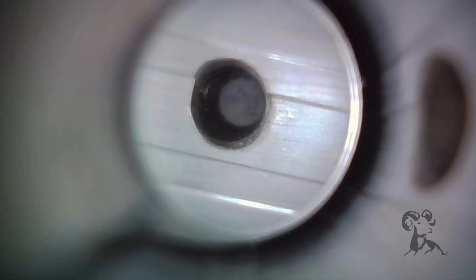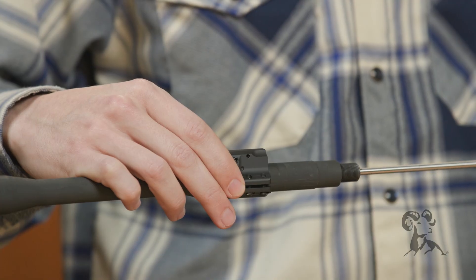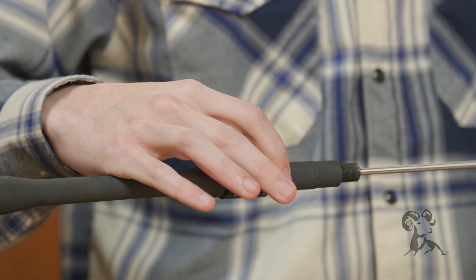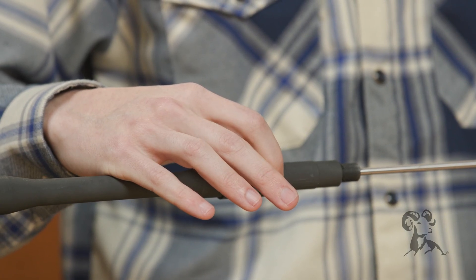So that is the gas port in the barrel. As you can see, it is blocked by the gas block — that's our gas block moving around there. There's alignment right there. That about right there is the gap for the ring. But if I push it all the way in, it's still there — still oversize. So it did not matter at all.